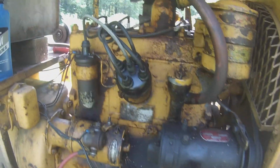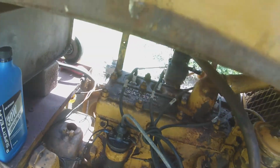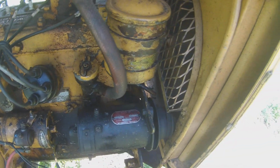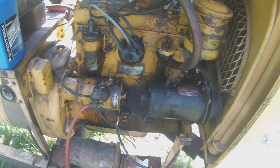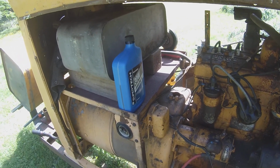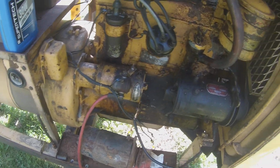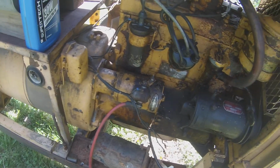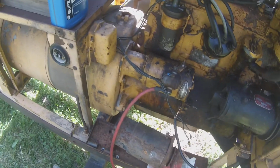Has a CJA tag on it. Of course, you can see the industrial head, low compression. I mean, there it is. It's like you just ripped it right out of a Jeep and stuffed it in a welder. .30 weight. I was running 10W-40 half synthetic for a while, and after it got hot and was starting to idle, I'd have like 10 pounds, and I know 10 pounds is kind of enough on idle, but I still want a little more oil pressure than that.